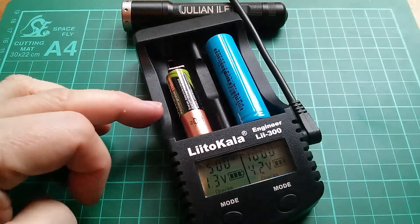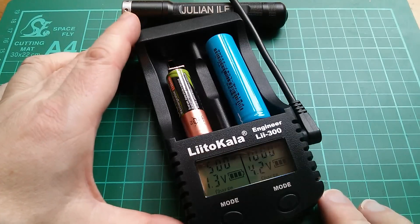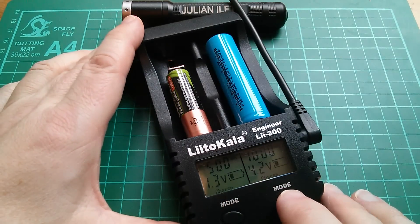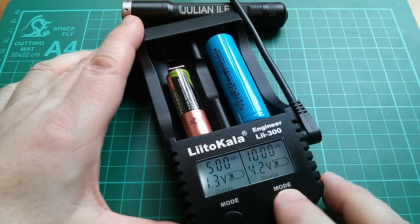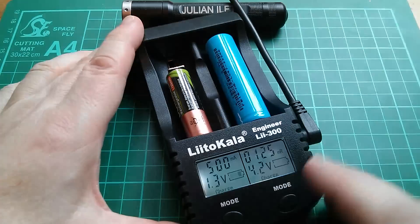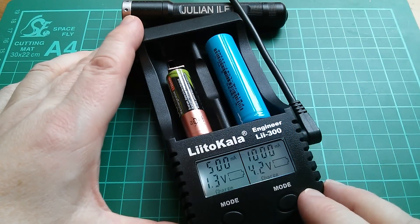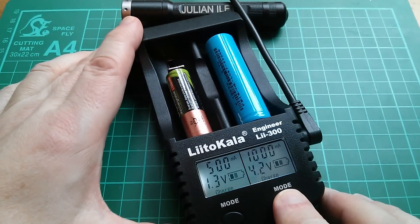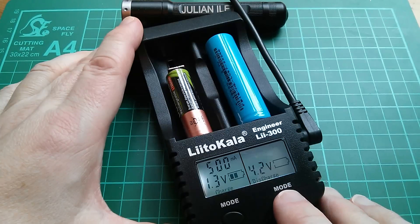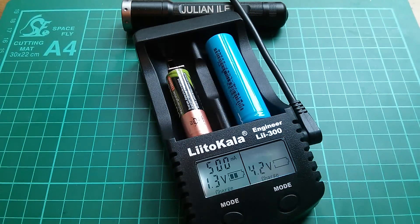I've put a lithium-ion in one slot and a nickel metal hydride in the other, and I'm going to go through the user interface. It's extremely simple — refreshingly simple you might say. There is just a mode button for each slot. If you press the mode button when the light is off, it just turns the light on. Cycling through the information: we've got milliamp hours, total elapsed time, the internal resistance from the initial check — that doesn't update it would seem — and current. You can change the current when you first put the cell in, but also if you hold the mode button for three seconds, you can flip it from discharge to charge, and set the discharge current to either 500mA or 1000mA. Press and hold again to set it back to charge and select the current — either 500mA or 1000mA. After a few seconds, that stops flashing and the cell starts charging.